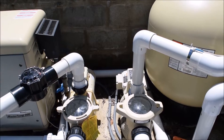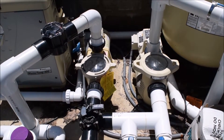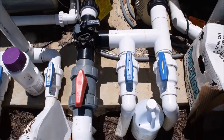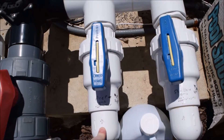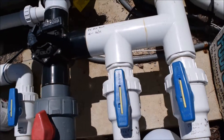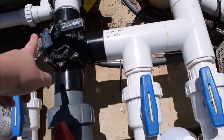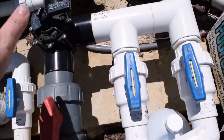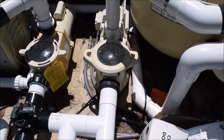Quick operational tutorial about your pool equipment. You've got two pumps: the pump on the left is for the waterfall, the pump on the right is for the main filtration system. In front of the pump you've got three valves — the one on the left is the main drain, the one in the middle is for your deep end skimmer, the one on the right is for your shallow end skimmer. This valve that you never want to touch is diverting; it separates the main drain and the waterfall from the rest of the pool. For normal operation, leave it exactly as it is.